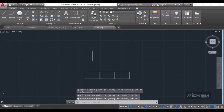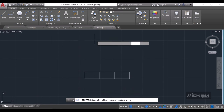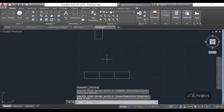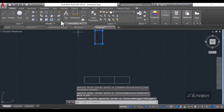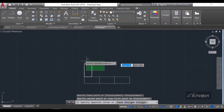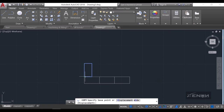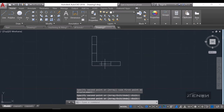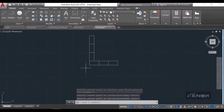Then the third brick. I'll have to create a joint around here, so I'll grab the rectangle tool again and draw a vertical brick — this will be 112.5 by 225. I'll move this and put it right there, copy it to create the next brick, and just like that we've created the stretcher bond — this is plan course one.